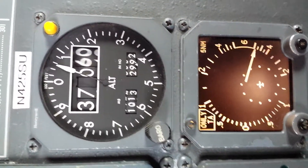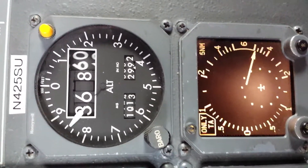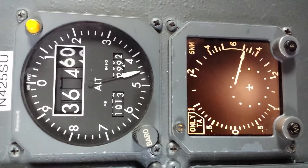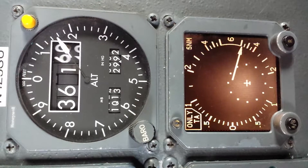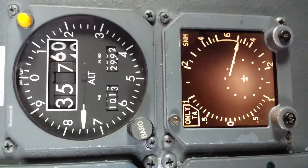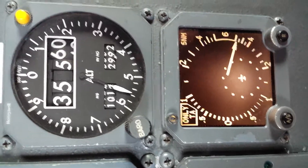So I'm going to let this unwind for a minute, and when we get down to 22,000 feet, we'll take a reading at 22,000 feet for hysteresis, which is half of the maximum altitude, or the closest test point to half of the maximum altitude of this test.